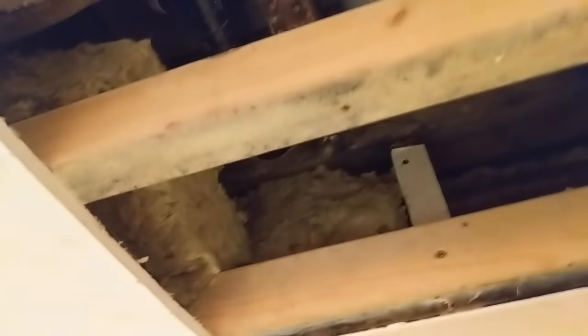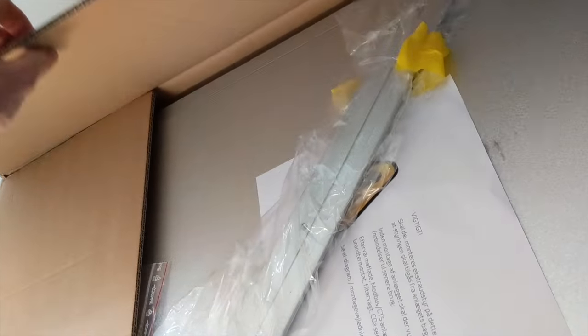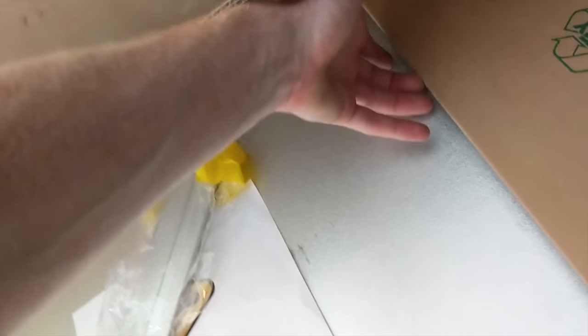I can sort of measure the depth — I've got about 100mm, maybe 90mm clear to run ducts. There's actually a lot more room in the bathroom and in the bedroom. I went for this unit in the end because it's got slightly lower flow rates and it's slightly smaller so it'll fit into my ceiling cavity.